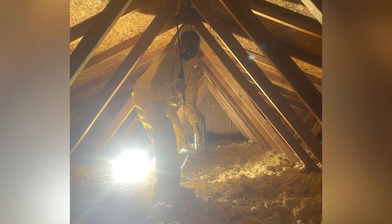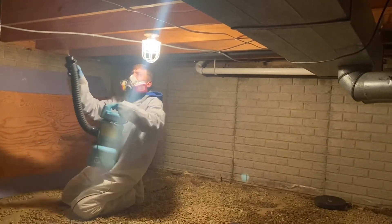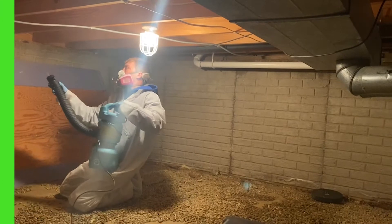When it comes to the myths of mold, bleach is absolutely not the answer. What you really want to do is physically remove the mold, vacuum it, disinfect the area, wipe it down with stain remover if needed, and fog the area to get rid of any mold spores floating in the air that could affect your health. The biggest key: stop the water, stop the mold, create a healthy environment — create a healthy home.